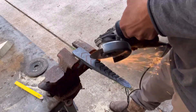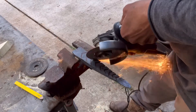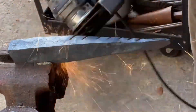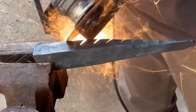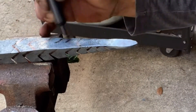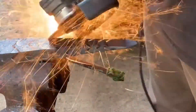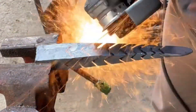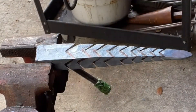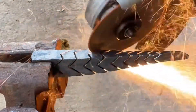I'm starting to cut in the lines of the geometry. For the initial cuts I'm using a thin cutoff wheel, making 45-degree cuts into the corners. As you can see, I'm drawing like arrowheads or triangles, having the end of each line meet the other line. This creates the geometry that looks like a scale pattern.